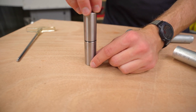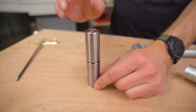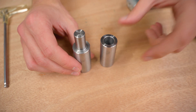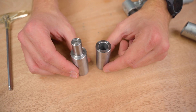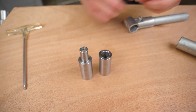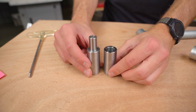This is from a company called Sidco Supply, and this is a barrel hinge that they make for welding onto steel frames for gates and things. What's really cool about this is the fact that it actually has an outside diameter of .94, which if you know anything about EMT Conduit and 3/4 inch specifically, the outside diameter is .92 — so it's just .02 larger, which is close enough that you can actually use this with your Maker Pipe connectors in your builds.